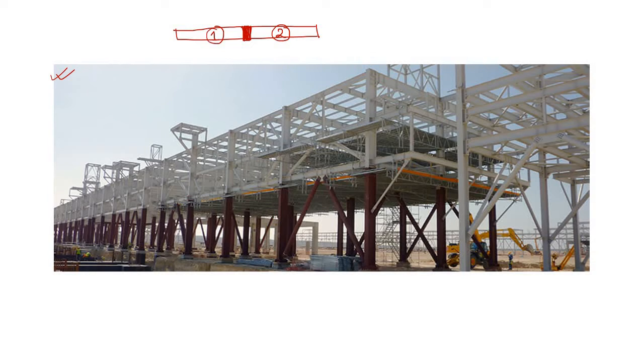In this figure you can see a picture of a pipe rack. The bottom part has been constructed at site, and the whole top portion in white color has been transported from the shop and placed over the red column. At site, a bolt arrangement was used to connect them — so you have made splice joints here, here, and so on.